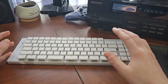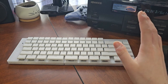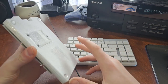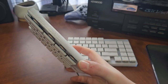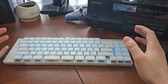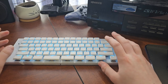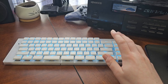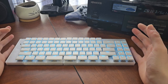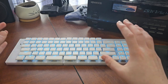Functionality-wise, the last keyboard worked wireless and could split between different PCs, but switching took about five seconds. Also, plugging it in would put it into debug mode for the ESP32. With Fendrana you can actually plug it into a PC and it'll type, so you can get into the BIOS. You can also change between PC and laptop within about half a second. Generally the firmware is just more stable — the Sanctuary firmware I wrote myself and it's on my GitHub, but ZMK is written by professional software developers whose full-time job it is to fix this stuff.